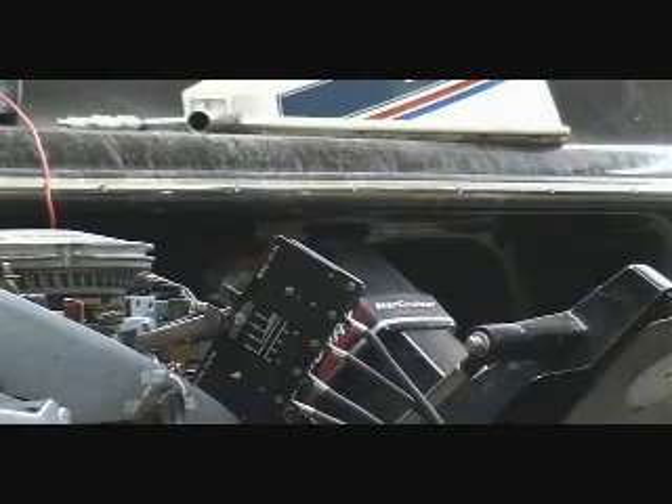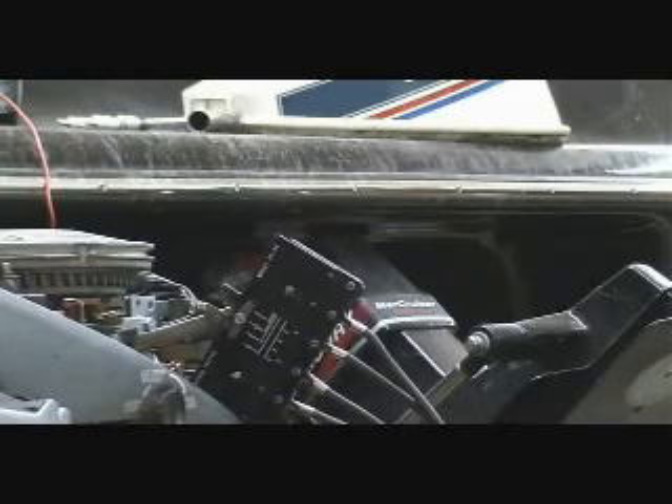What I'm going to do is replace the coil, and then run this simple spark check again to make sure we've fixed the problem. The new coil is in place — let's spin this engine over and see what we get. As you can clearly see, both cylinders are firing. We have confirmed that the problem has been fixed. The customer takes the boat back on the water and shouldn't have a problem, but I would definitely tank test it first.